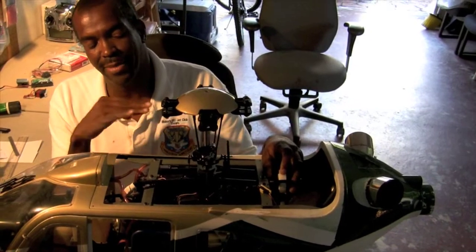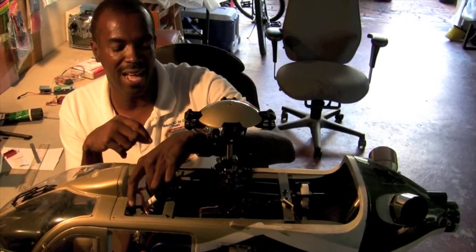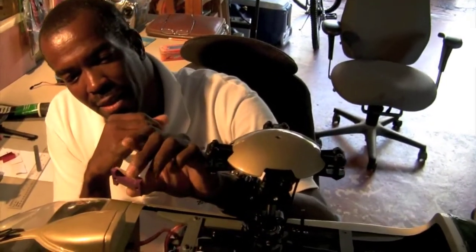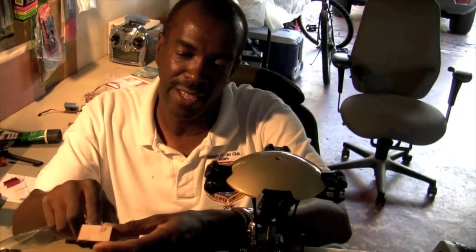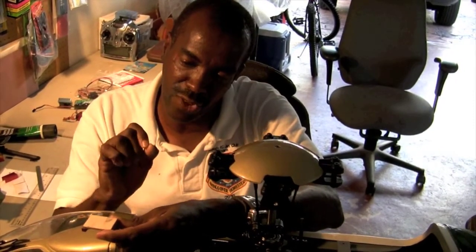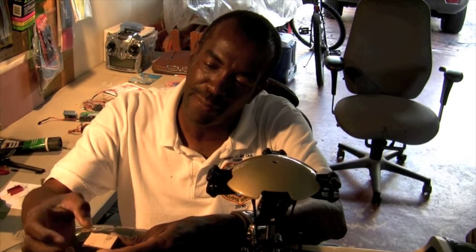One of the things I didn't realize is that sometimes I get ahead of myself — always read the instructions completely. What I did, I made a mistake. I didn't read the instructions; I just put the heli command in the slot and didn't realize that this heli command must be balanced. So I used the side frame mount from the frame itself and put it in a piece of wood block — the same dimension as the side frame. You should use about three-quarter inch plywood. Get that nice and level, and set the heli command — it comes with foam tape, make sure you use the foam tape they sent you — right in the center of this wood block. The measurement must be equal on both sides and front.